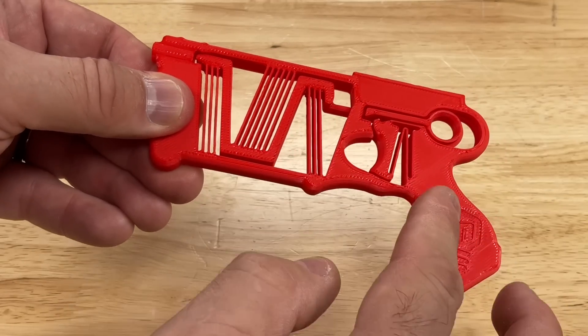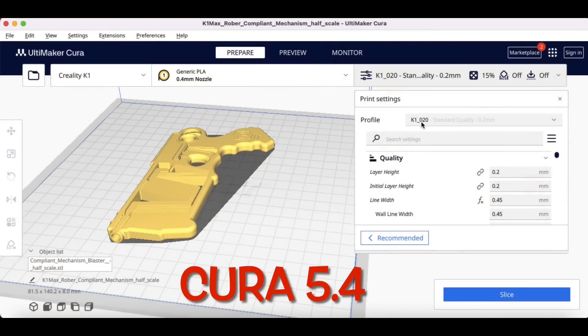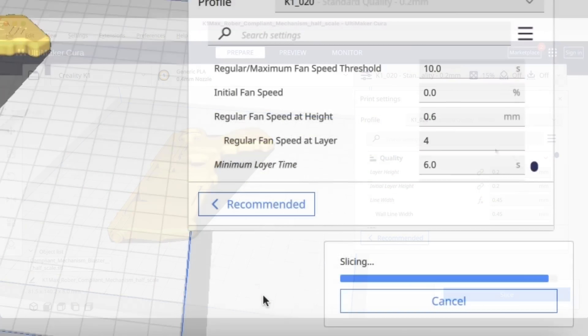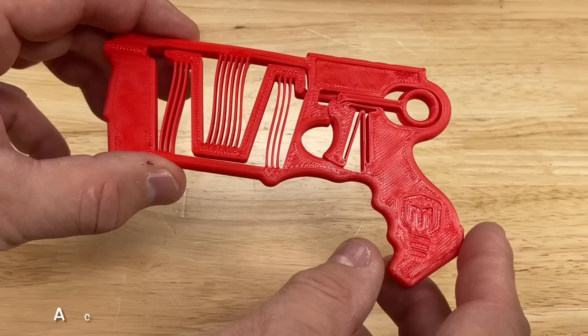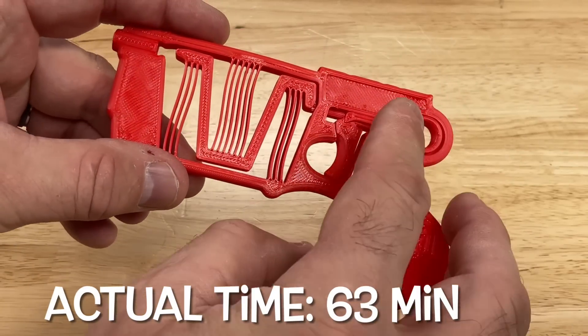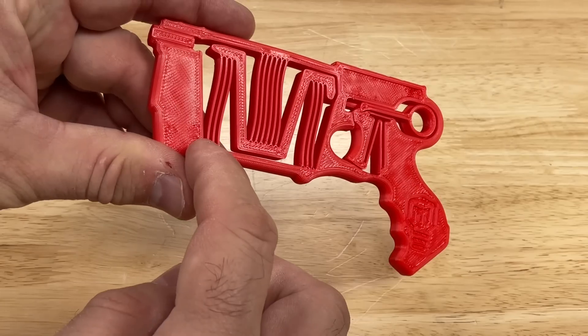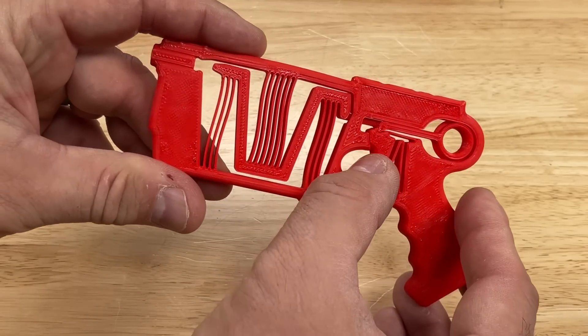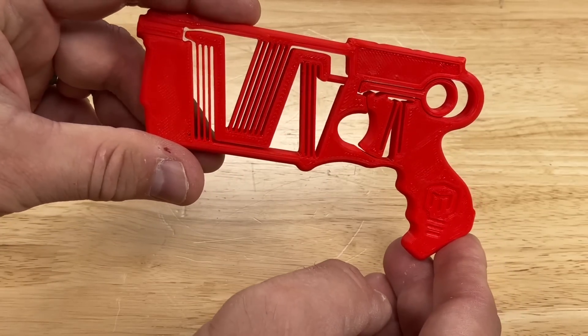The top surface is pretty smooth, there are no gaps — this is well done. I'm going to skip Orca Slicer and go right to my Cura profiles. Sliced at 76 minutes, but actual print time was 63 minutes. Although still longer, and I had a few spots where I could improve the top layer — something to fix in a future update. In this case Creality Print gave me a better print, but it still works and I'm happy with the results.